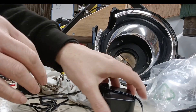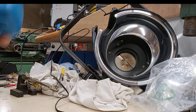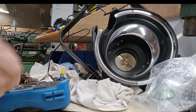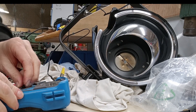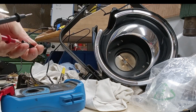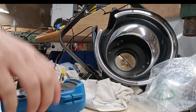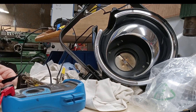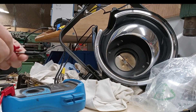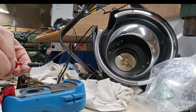Just going to check and make sure I've done it right. So it should be getting 12 volts — it'll be slightly more as it's not under load. It's about 12 and a half. And the polarity — let's have a look — is centre negative.